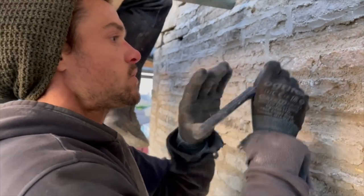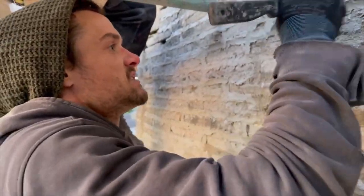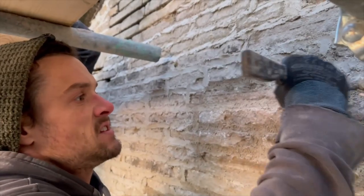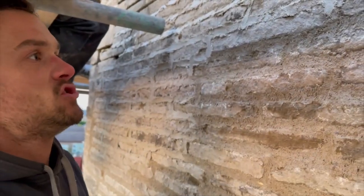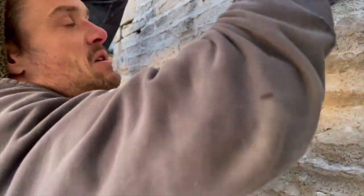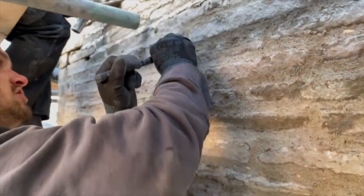There are different ways of dressing your mortar. Some people beat it back with a stiff churn brush the same day they've applied it. What you tend to find is that it smears the mortar over the face of your stone, which in my opinion looks a mess - and it allows water to sit on the face of the stone, which can become an issue especially with a softer stone like this sandstone. Although when using lime mortar it's always softer than the substrate you're pointing to, so it's never too much of an issue.